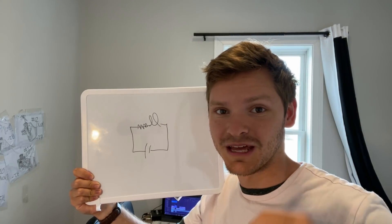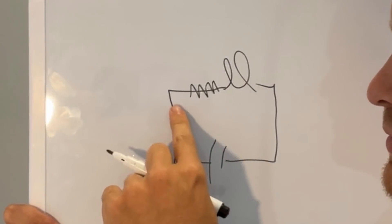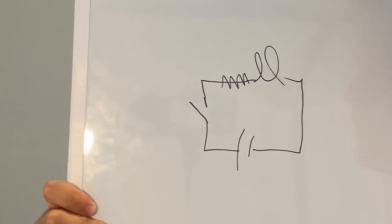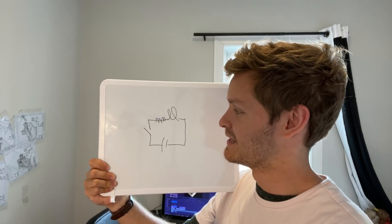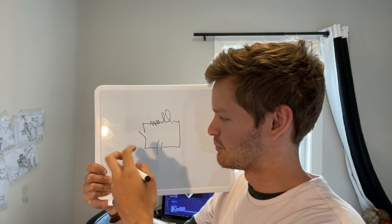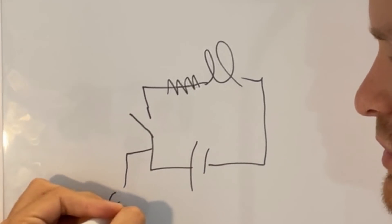We want to do it so that it's only when I click a certain button. Because you click a button, A is typed. So all we do is remove a piece of this wire, make it subject to a button, and now whenever this is clicked or closed, the circuit is complete and it types the letter A. Only other thing to consider is that when this circuit is broken, this has to go somewhere, so I'm just going to have this wire go to ground or something like that.